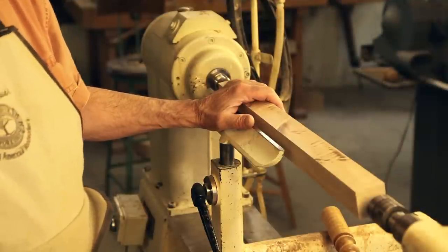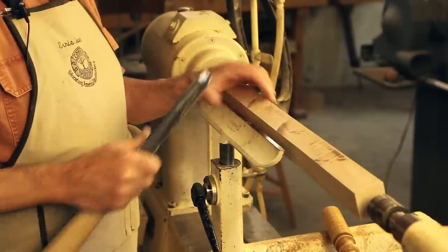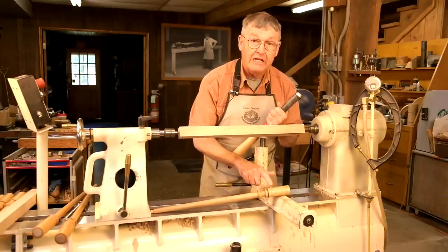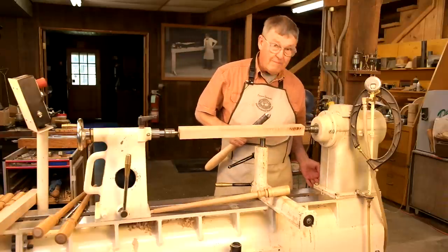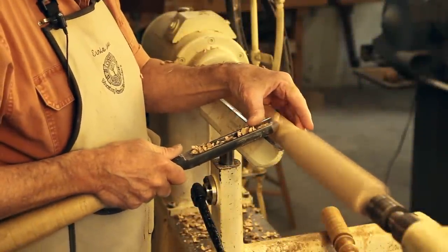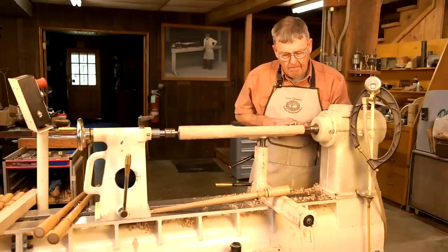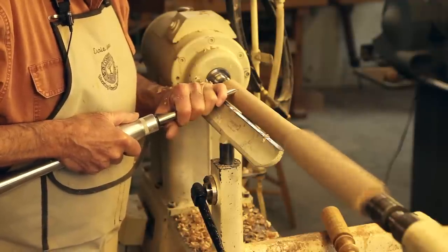To start the turning process, all I have to do is turn this piece just around and I will have the inch and a half diameter that is at the top of this spindle. I'll start up my lathe and turn this baby around. I'm getting close to round — I'm going to put my hand here now, just feeling with my fingers, lightly touching the work. I'll now use a skew chisel to make this area really smooth.